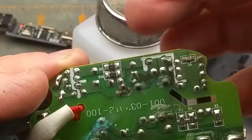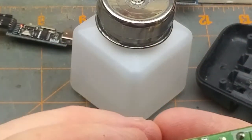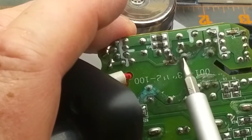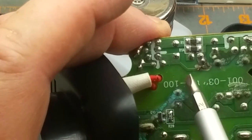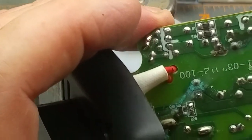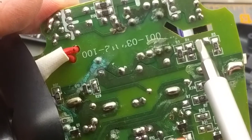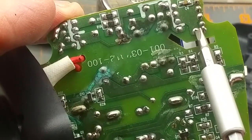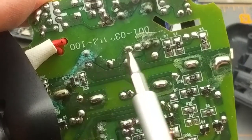Come back out a little bit — what is that component right there? These three pins in a row are windings on the transformer, they're in a straight line. So that's the high voltage side of the transformer up there, and this is the low voltage side of the transformer down here. These two are the low voltage side of the opto-isolator, these two are the high voltage side — or rather, this is the mains side and this is the isolated-from-mains side.